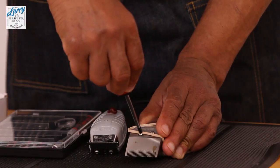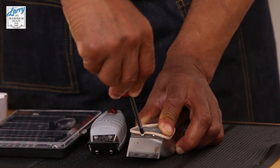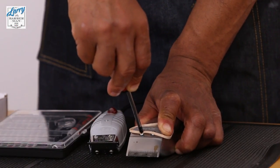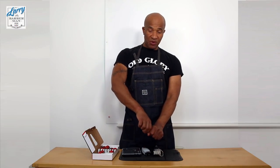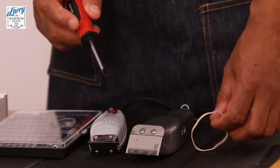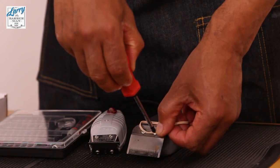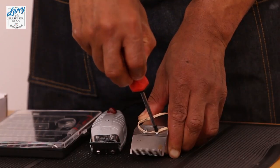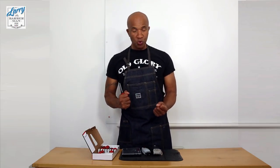Push down with a lot of pressure - this is why you need the good quality screwdriver - and that will give you the grip you need. The elastic band acts like a glove. It's like when you're trying to loosen a bottle of drink and you put a tea towel over it to get a grip. Place the rubber band over the stripped screw, apply pressure with the screwdriver into the groove, turn it, and it'll come straight out because the elastic band acts as a super grip.